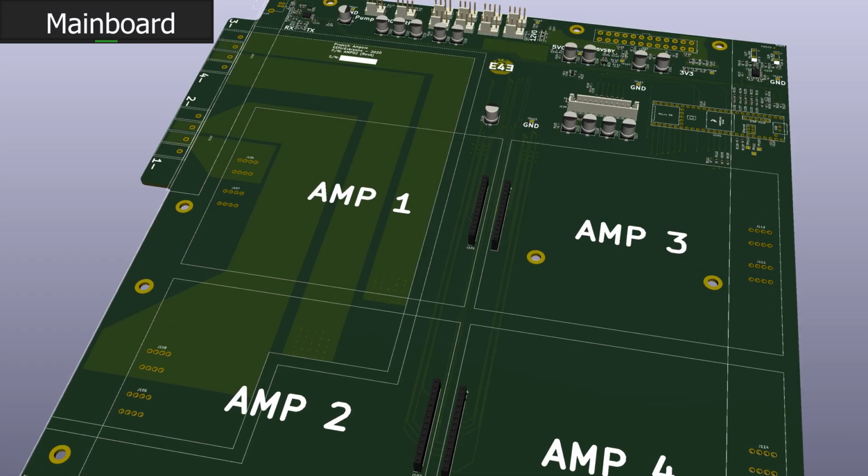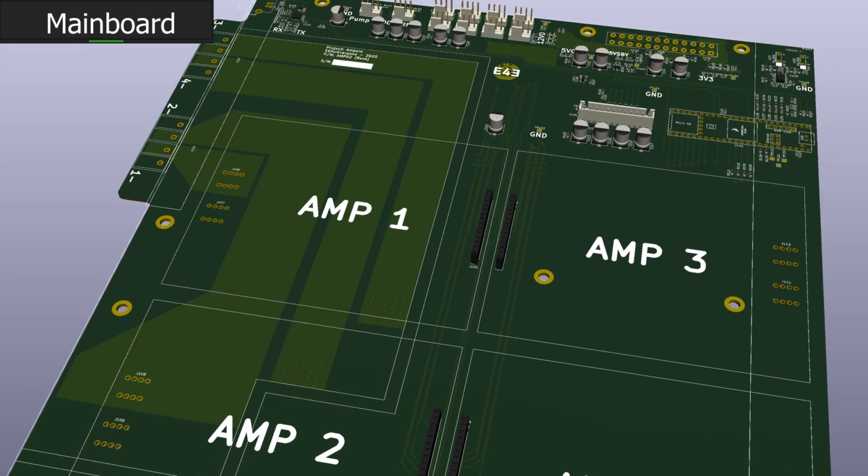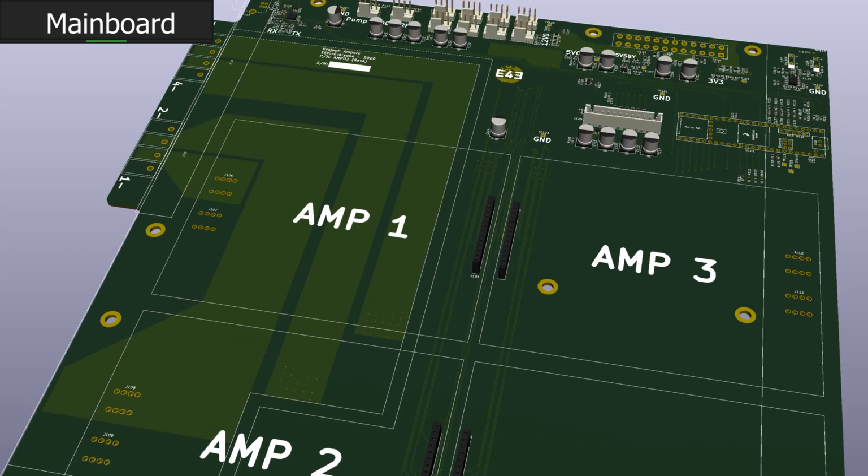All right, then on top of that, we can see that clearly, right, we've got the water cooling radiator, standard components for computers. We've got a lot of modular cooling, a lot of industry standards that we're trying to comply to. Well, we took a little page out of our book from the UPS project, and we designed the mainboard that will allow for controlling up to 4 of these front ends. Basically it passes through the power to the board and sends the control signals through. That mounts with the standard ATX footprints. We can use a normal computer chassis to house it. That allows for mounting our water cooling radiators, etc., etc.